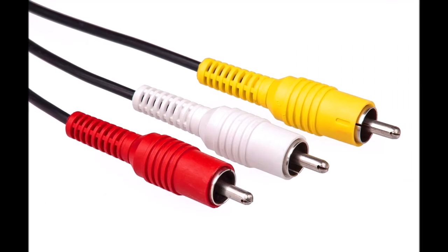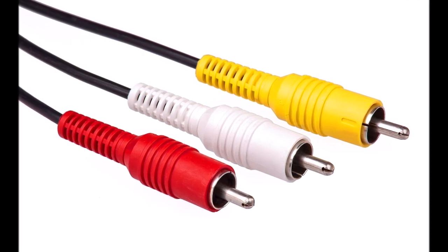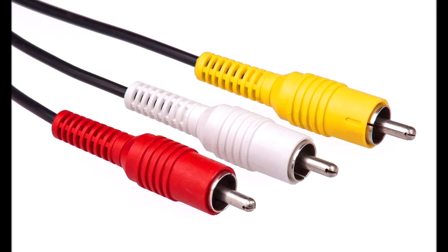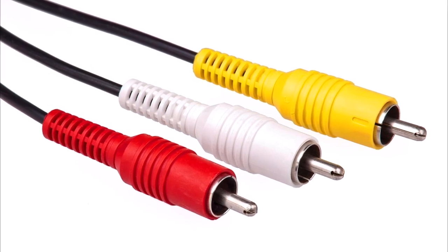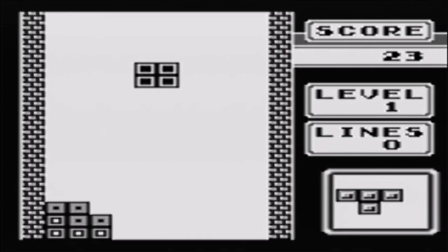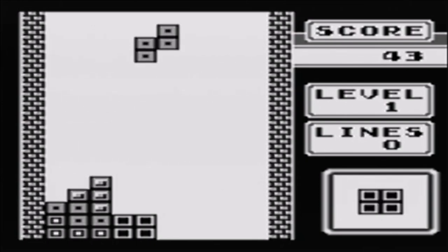As you can see, composite video became the basic standard throughout the 90s and early 2000s for video game consoles. But it wasn't the only option, and there was only one way to go but up. That is to say that composite video's quality is quite dark and muddy 480i due to it being crammed through one RCA cable at 15 kHz. It's definitely a step up from RF, but especially on modern displays and capture, it looks especially awful, since the CRT effect can't mask the weak 480i signal.